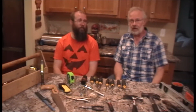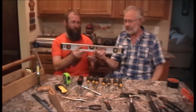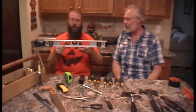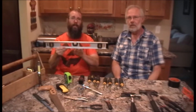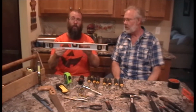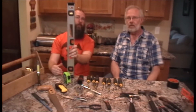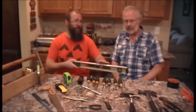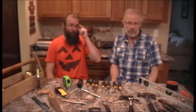As you're putting things up, you want to make sure they're level because if the shelf's on an angle, things roll off and fall on the floor — it kind of defeats the purpose. Use one of these — it's a level. If it's level, there's a bubble in the middle of this gauge that lines up between the lines. You can also use it on the vertical edge to check the flush or plumb of something — to get it straight up and down.